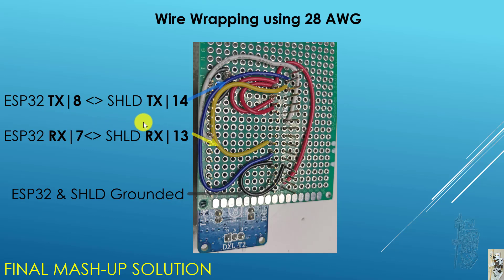If you've used cross-wiring before with devices like BT-210 or BT-410, that's different. In this case, the DXL Shield is considered part of the ESP board — so direct connection: RX to RX, TX to TX, no cross-wiring. The Shield uses A6, so that part stays. But on the ESP32, you can use another pin if you want — I just use A5.